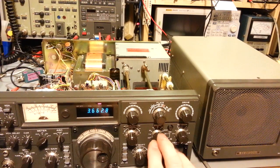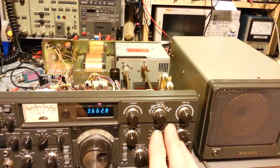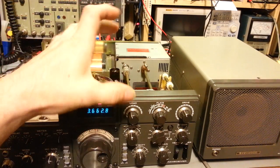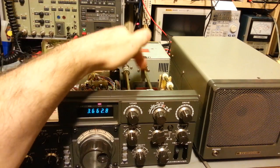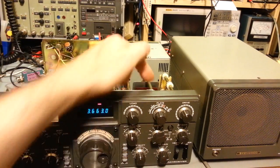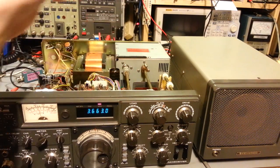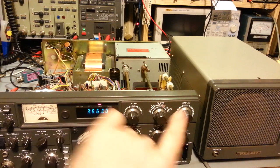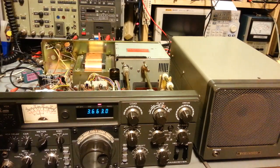And I guess a tip I could give, if you do change this coupler: the shafts have flats on them. The rear switch is actually a switch with 3 sections, and it has its own little shaft. Each of these switch sections up here are all controlled through this front shaft that runs the whole way to the back, and actually just slightly inside the RF cage back here. Now it has 2 flats, and then it's like a half moon on the other sides of it. The one in the rear section has 4 flats.